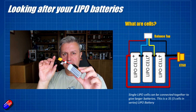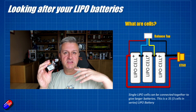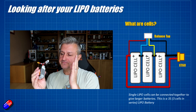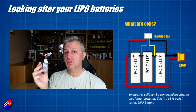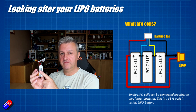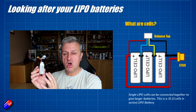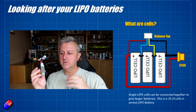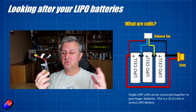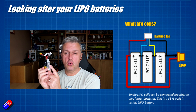In a normal charge, the current is pushed back through the XT60 through all of the cells, and that electrical current is turned back into chemical energy stored within those individual LiPo cells. Ideally you want all the cells to be at 4.2 volts, so they all do the same amount of work and are all under the same amount of stress when you use the pack. But it might be that some cells are slightly better than others — some might reach 4.2 volts first while others are still at 4.17 volts. With decent batteries, I tend to just use a regular charge because a good battery with evenly matched cells will get them to be almost identical every time.